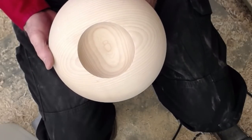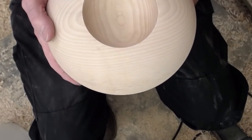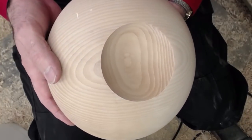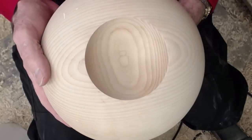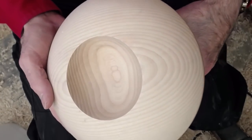I've got a spindle gouge here — going to make a little roll, a little bead, and then clean up the inside of the bead with a steep angle from the spindle gouge. We've got to have this all sanded now and nice. We got lucky here — look at the grain character, nice and balanced, just what we were after when we removed the wood between centers.